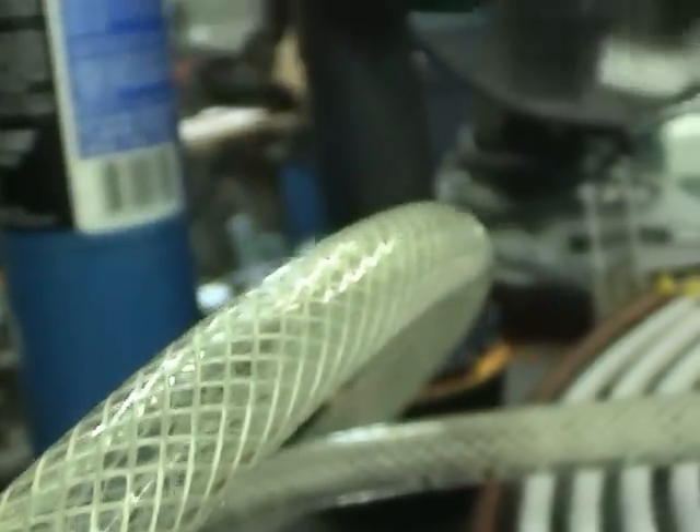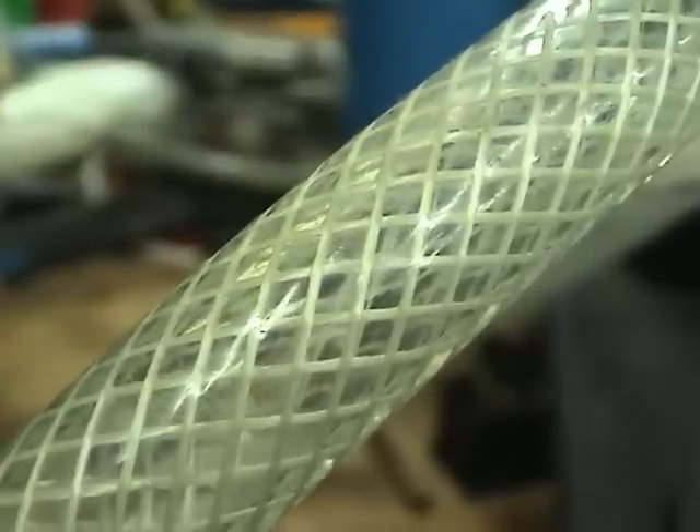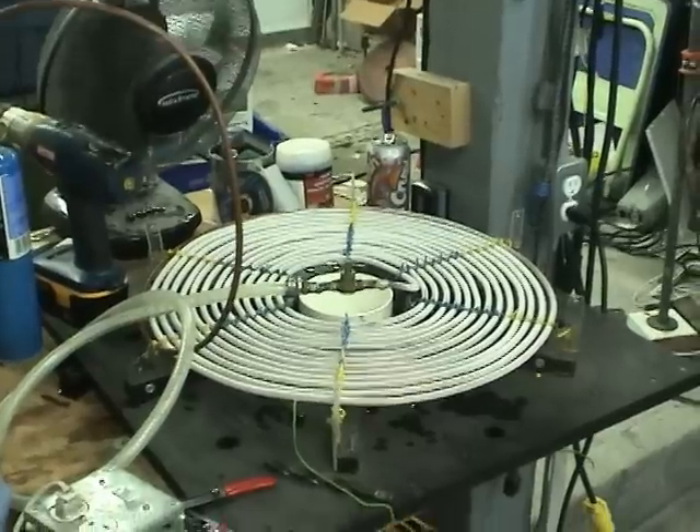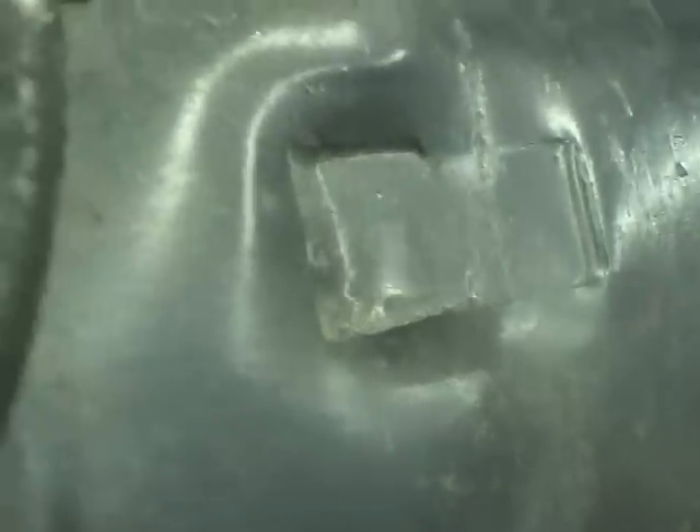I don't know how well you can see this, but there's a pretty good view here of the liquid coming out of the condenser. It's going over the top of the hill up here and flowing down, joining this little pool down here. It's sort of interesting to actually see the liquid refrigerant moving. That's really frozen up well now. If I bring the camera over here near the compressor, you might be able to hear the very low frequency sound it produces through the pump at such a low speed. Hopefully you'll be able to hear that. I'll see you next time.